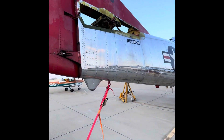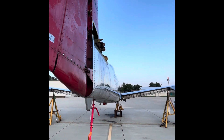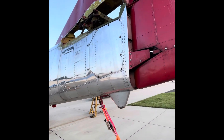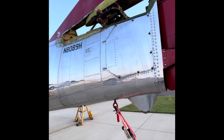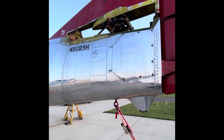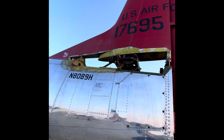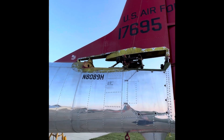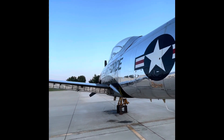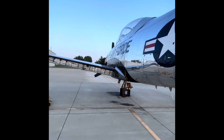Took the tail off because it's 16 feet wide or something, so those come off fairly easy. The T-28 horizontal stabilizers and elevators are interchangeable left and right — you can put them on either side and the trim tabs and everything work just fine. I think the ailerons are also interchangeable, and the main landing gear are interchangeable left and right.